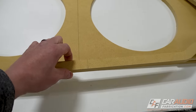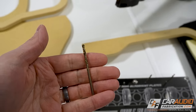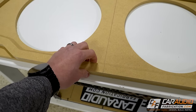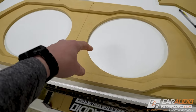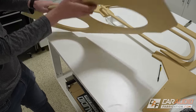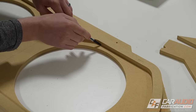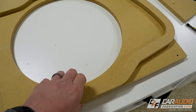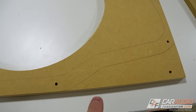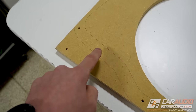One piece that isn't going to be screwed on is this piece here — I simply don't want to show any screws on the outside when I attach it to the enclosure. Rather than relying on material fitment between the vinyl layers for a press fit, I want to use some magnets to hold this on. The first step is using this drill bit to transfer the center point of each of the magnet holes. I'll position the piece exactly where I want it and drill holes from the back side, then flip the baffle board over and trace the outline onto the back.